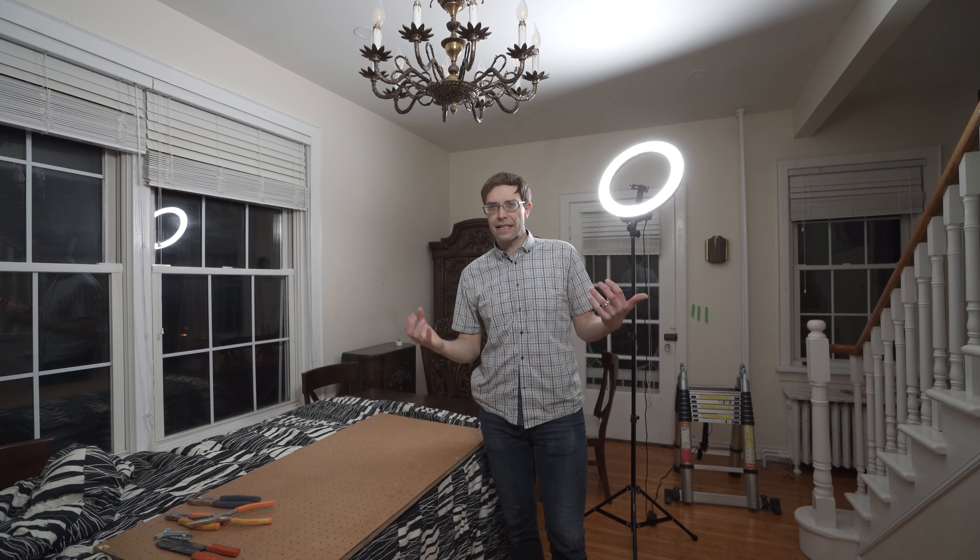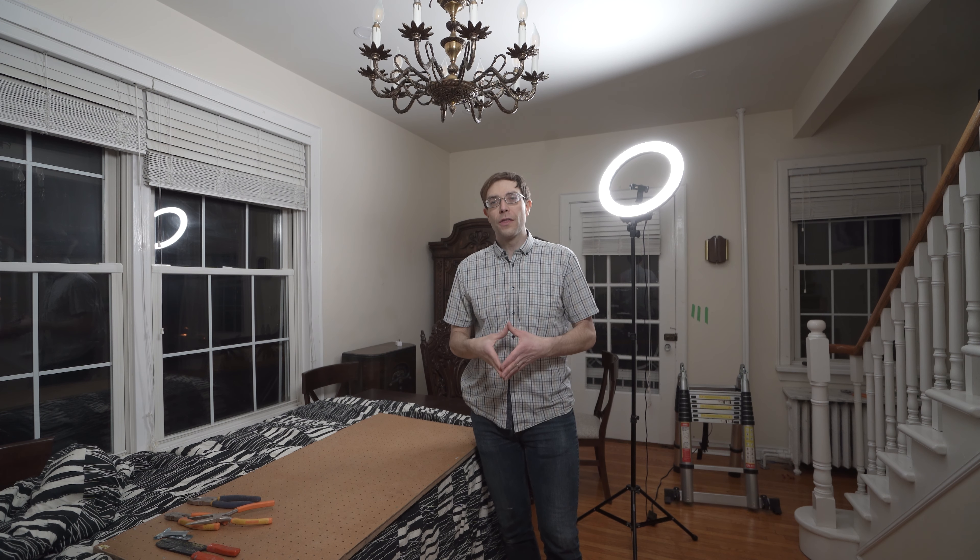Apparently the entirety of upstairs bundles through that box up there — all the wires. There are 28 hot lights, six-ish outlets, and one chandelier, all on the same circuit, wired with a 14-gauge wire, protected by a 20-amp circuit breaker. I lost track of how many code violations that was.